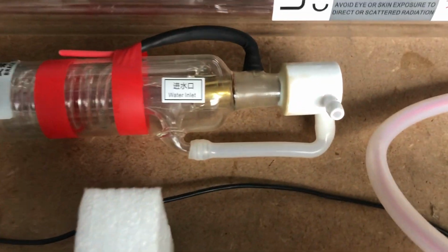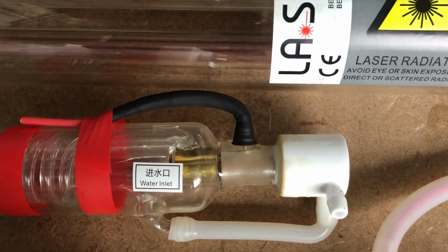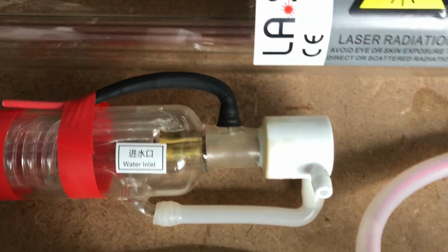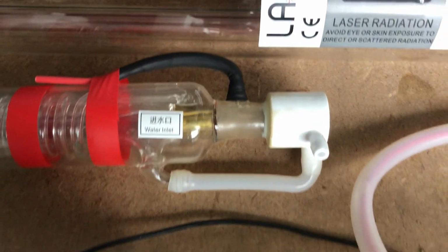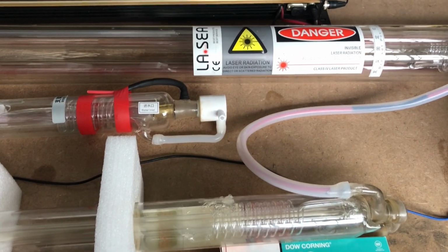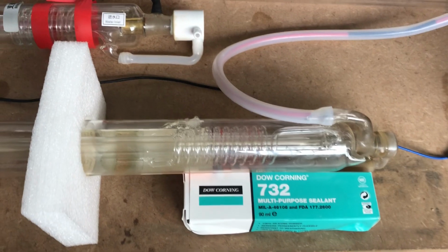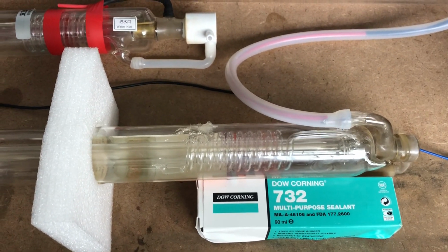High voltage: you want to make sure that everything's pretty well insulated on your high voltage connection. These nowadays they come pre-tailed, but if not, make sure that your HT is well insulated. Resin filled heat shrink, rubber tubing, 100% silicone rubber sealant.